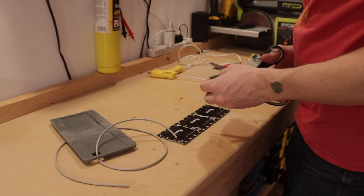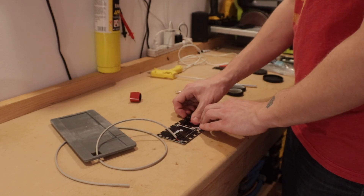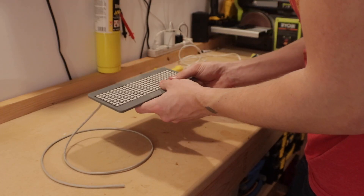Next, I mounted the LED panels inside the bracket using some VHB. VHB is a kind of foam tape made by 3M and this stuff is awesome — it's insanely strong, and because it's foam tape, it will adhere to kind of weird surfaces and fine crevices to grip. If you don't have VHB, some double-sided tape or hot glue will work just fine.